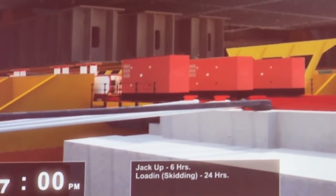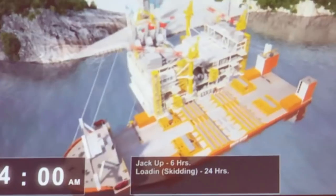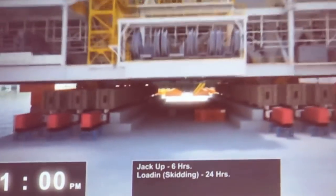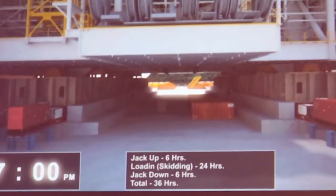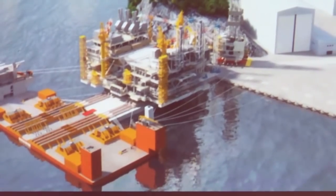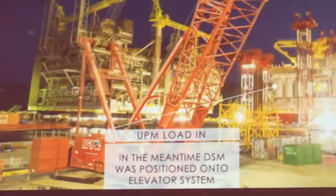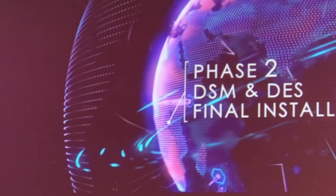We have a very narrow area between the load spreaders underneath the UPN modules for access of the skidding system. There was a four-point loading system, and the beams spread onto the four points of the UPN modules. The module was skidded onto the pier as mentioned, already waiting to be lifted and skidded onto the UPN. You can see the module already on the elevator system, with the skidding operation being performed — again a couple of days, or a little less, from initial position on the ship.